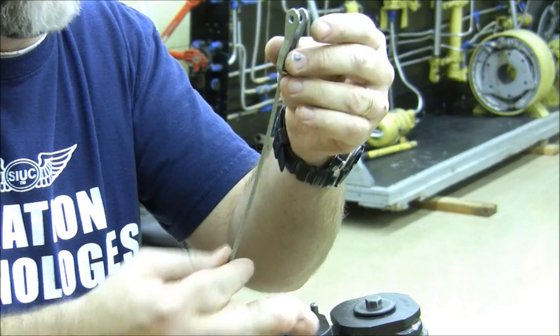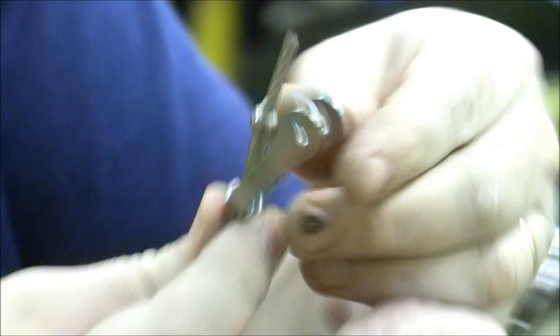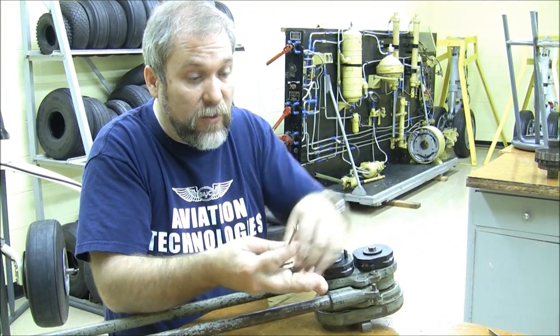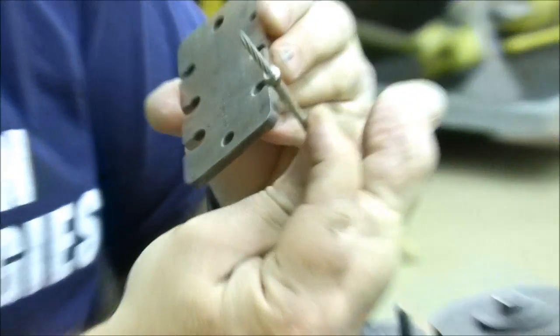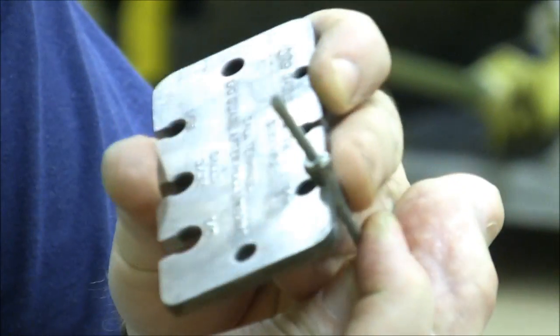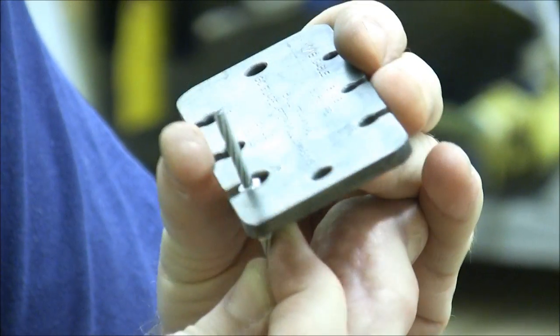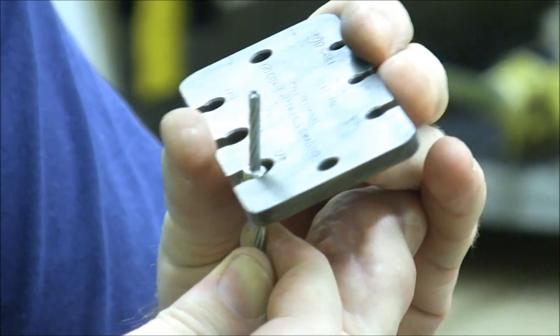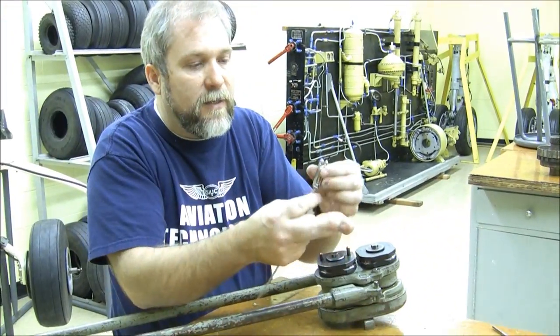Notice that the ball terminal now will slide up inside our fork end, and of course we'll have to trim a little bit of cable off of it, but that will give us a good ability to join that onto whatever we need to join it. Let's inspect it to make sure that it's appropriate. When it's complete, the sleeve should fit through the sleeve side, and our ball should fit through the ball side of the go-no-go gauge. That tells us that we have appropriately swaged this ball, and it is ready to go. We just made a ball end.